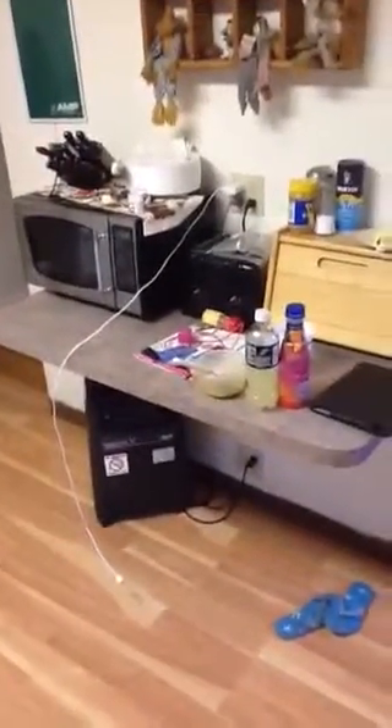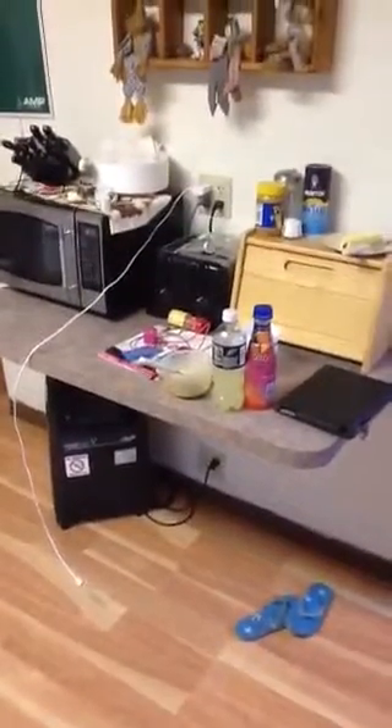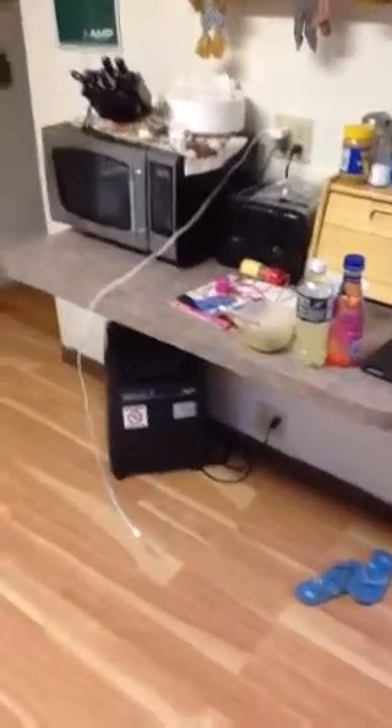Basically we're doing new cabinets — we're not gonna move any walls. This is what we are working with in this particular area. There's also a floating shelf here, it's 48 inches wide at the standard cabinet depth of 25 and a quarter inches. We're gonna raise this up about four inches and add a pull-out, like you would have for office supplies, underneath for her.